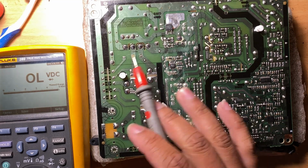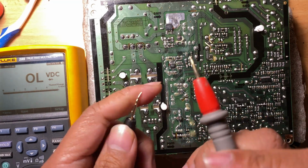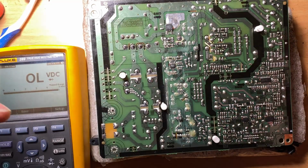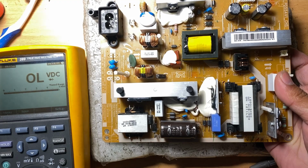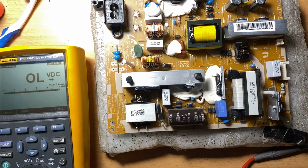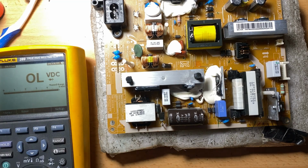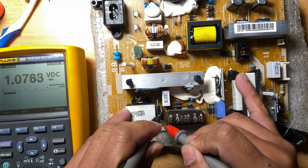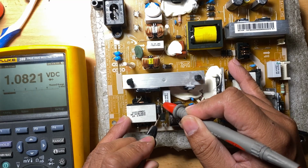And let's check for other components. We'll look for shorted pins that are very near to zero, like 0.000 or something. In this case, you have to find the very obvious ones that go bad, like big semiconductors. They usually go shorted, like these diodes here. Check all semiconductors first. So this one, it's good. Short or leaky ones, you have to check. I think this one's good.